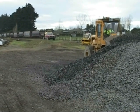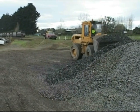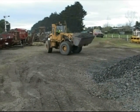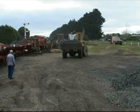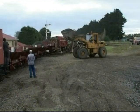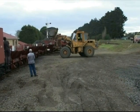Once we finish the job of laying, that's effectively half of the task. We've pre-built the track sets, we've lifted the old ones out, we've replaced those with the new ones. The next three phases is we'll go through and fully ballast using proper railway ballast with our ballast wagons, which we have a generous supply of here on the Glenbrook Vintage Railway.